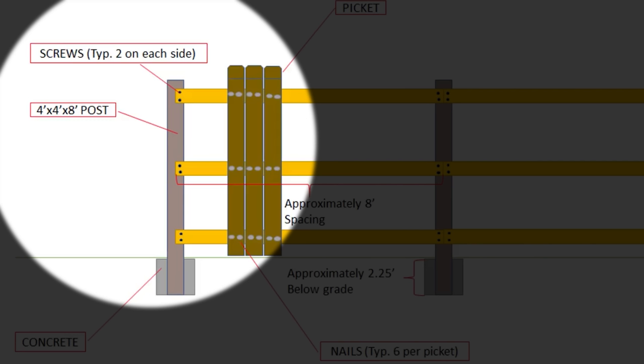It's interesting he's going wood 2x4s to wood post but securing them with screws. You see screws used more on the DIY side than on the professional installation side. On the professional side you think about economics and efficiency, and we use ring shank nails. Our experience since 1955 is that ring shank nails don't pull out of the post unless the post is already rotted and ready to be replaced anyway. The one case we will use screws is when we're using a steel Postmaster post — we go through pre-drilled holes in the steel post into the 2x4s, and screws make more sense in that scenario.